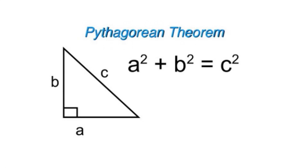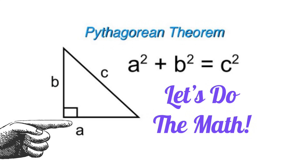The reason rafters float past the beam is that sometimes you need an air gap to let air flow out of a ridge vent on your roof, if you're not doing spray foam — which sometimes we don't. But if you're a numbers person, you can also just do some simple math to figure out the length of the rafter from the same points.